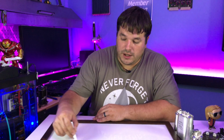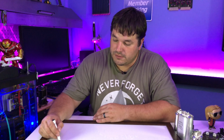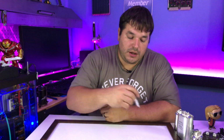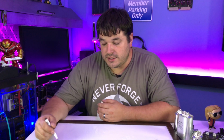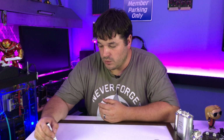So I have a line coming in, and this is going to be direct current. Let's just say for ish and giggles, we're going to call it 100 volts DC. All right? So we got a 100 volt DC line. Now, whatever our load is out here, we're going to draw the load as a resistance. Whatever our load is out there, that might need more than, let's say I can supply 10 amps. So 100 volts at 10 amps, it's like 1,000 watts. I'm supplying 10 amps. Now let's say for small periods of time, I need more than 10 amps.